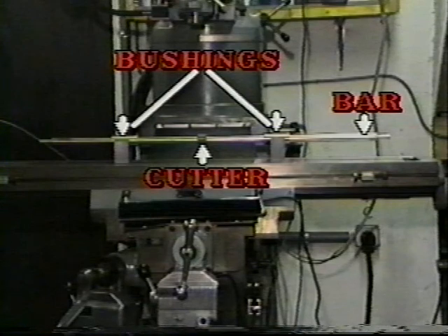The Quick Bore system uses the following components to line bore. The heart of our system is a precision ground and hardened drive bar with replaceable half-inch drive ends. The diameter of the bar is seven-eighths and can be used with ALM and ALC cutters. The lineup bushings are precision ground, tapered, and case hardened to provide a perfect center of bore every time. Our cutters are designed to cut and ream in one quick operation. The setup is quick, the boring is precise, so the job done is of the highest quality — and so are your profits.